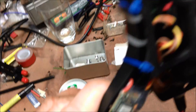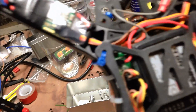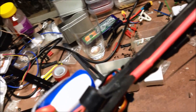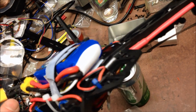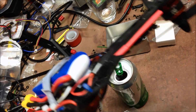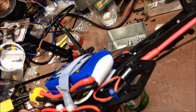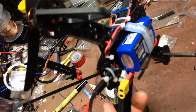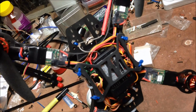I added in the battery voltage from the KK2, which goes to the battery sensor so it'll beep when the batteries get low. It's a 3S battery so I've set it at about 10.6 - there's enough time to get it back down. And that's basically it. Let's see how she flies.